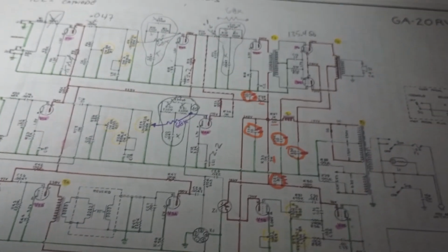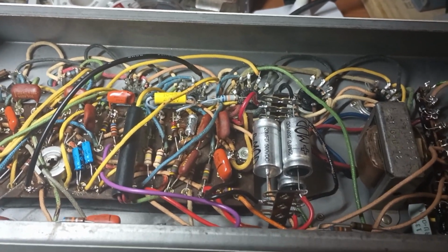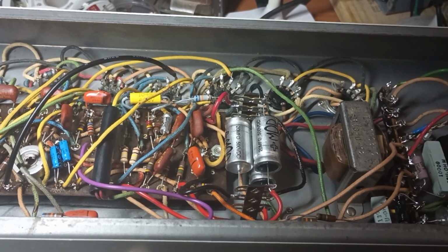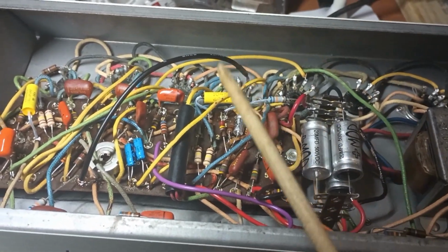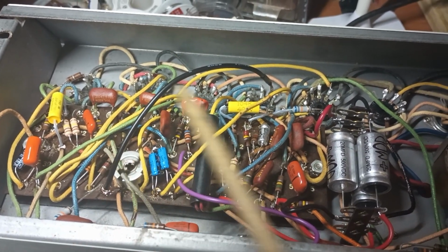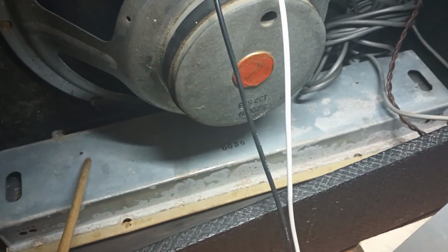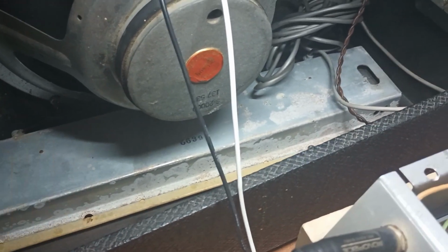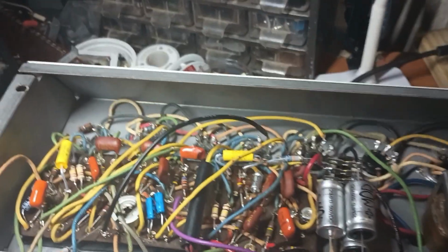which is making me think, because this amp, I said, with the reverb on, there's some kind of leakage or some oscillation or some microphonics going on, and I had the same problem with the other amp. It's making me wonder if the grid wires associated with the reverb portion of the circuit could be to blame for that. Could also just be worn out, tired reverb tanks. But on the first one of these amps I did, I tried several reverb tanks, and it sounded great with the tank outside of the chassis, like on a pillow. But the other amp especially, you stick it inside here, it was just absolutely unusable. It would just self-oscillate into oblivion.